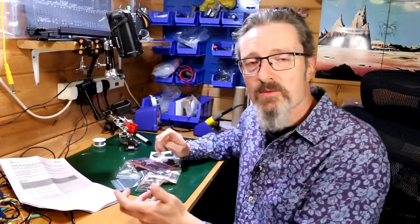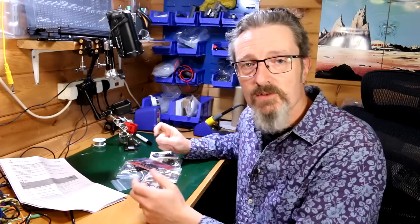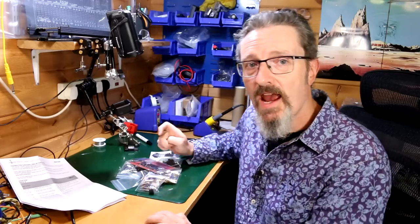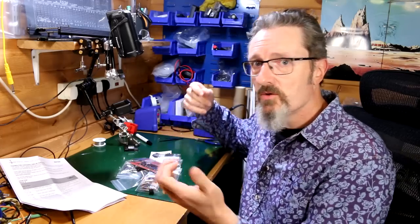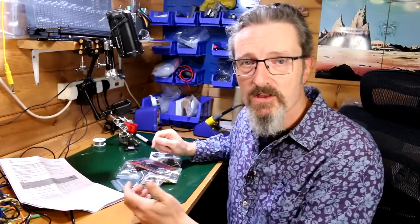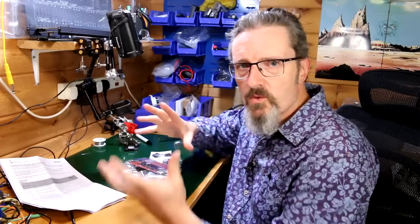It's got phantom power for your microphone. It's got an impedance switch between guitar level, line level, that kind of thing, and it has a built-in envelope follower, which means that essentially when you play guitar, play a note or sing into it, it can take that as a trigger and stuff that into other things in your modular. From my very simplified point of view, what it means is that I can plug a microphone into my Eurorack and start using my voice within it. And that's very interesting to me.